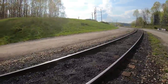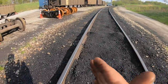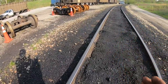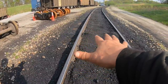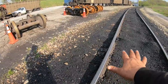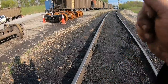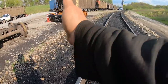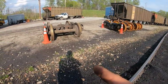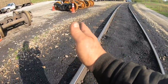This is about a 3 degree curve, but I think I can explain it here. When this truck set goes into this curve, it's got a swivel — that truck set has got to be swiveling. It hits this rail, the front wheel hits that rail, and it's like steering your car through a curve — you've got to turn the wheel. If you don't turn the wheel, the car is going to go straight. Now, if that truck set gets bound up and doesn't want to swivel correctly, it's going to want to keep on going straight.